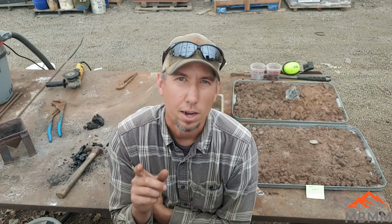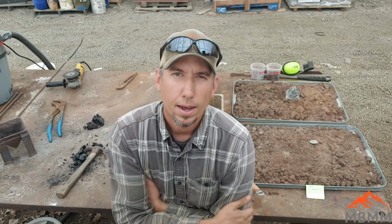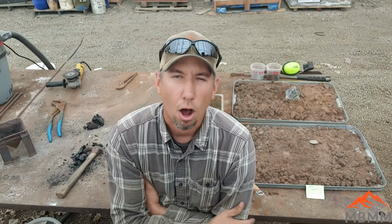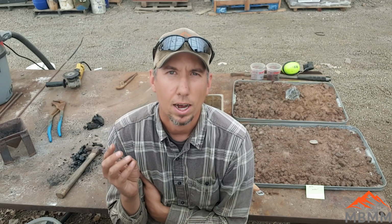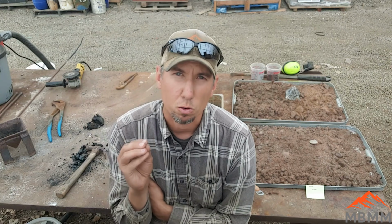But the other thing that was kind of cool is that little brittle metallic block that we did, where I added 100 grams of sulfur and I just flooded the whole system with sulfur. Almost all the other metals got eaten up. The tin actually seems to be really not very reactive with the sulfur, so we had a lot of tin. We had a lot of copper in there as well, but it made it really, really brittle.